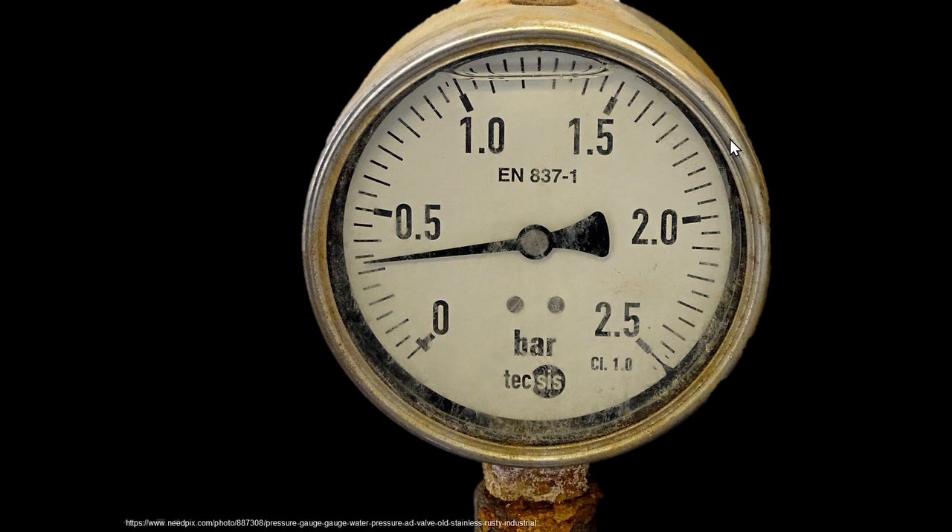Let's look at this pressure gauge measured in bars. This is 0.5 — so that's 0.1, 0.2, 0.3, 0.4, 0.5, broken up into smaller units. If that's 0.3, that's 0.35. I can guess to half the smallest division; the smallest division is 0.05, so I can guess to 0.025. I would say that's 0.33, and instead of 0.025 I'm rounding to 0.03. If our guess is in the hundredths position, our plus or minus value also has to be in the hundredths position.